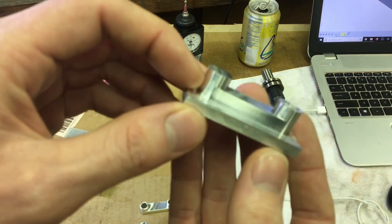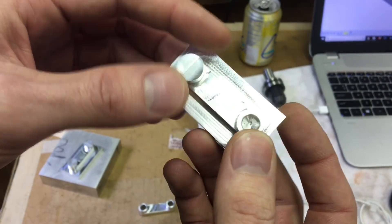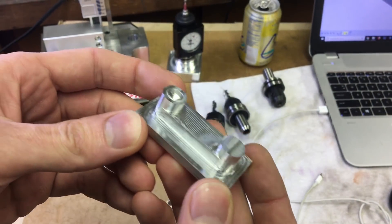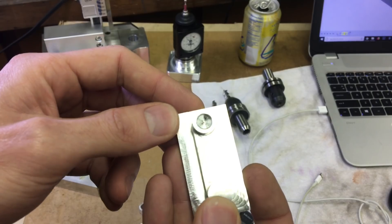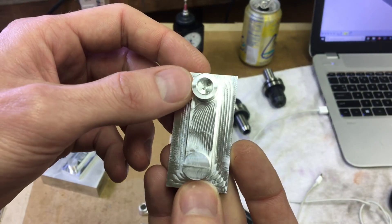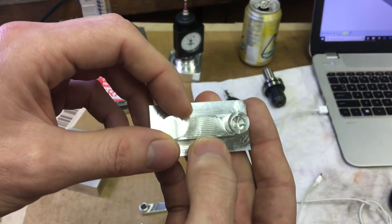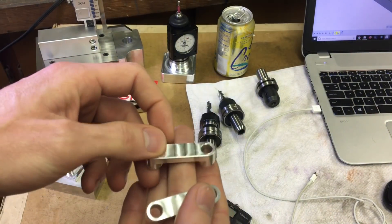This was the second one, working on the finishing after the adaptive. This was also the first attempt at drilling a hole — five-sixteenths, I believe. On that first hole I accidentally forgot to add it in the tool table — it was like five hundred thousandths too short. I hit the e-stop. Yeah, close, but we didn't break anything, so I was pretty excited. Some things I noticed, some things I learned.